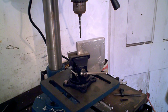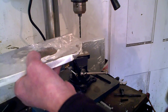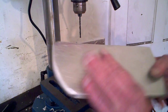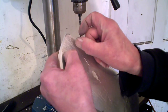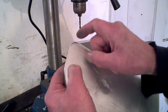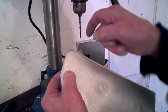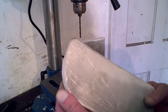Set up to do this job, which is to put this flywheel spindle support on the base plate. I've done enough that I can do that, and it's not critical where it goes, except I've got to leave enough room this side for the flywheel and my little crankshaft piece I'm making, the outer round piece I showed you on the drawing. But I've changed my mind slightly.